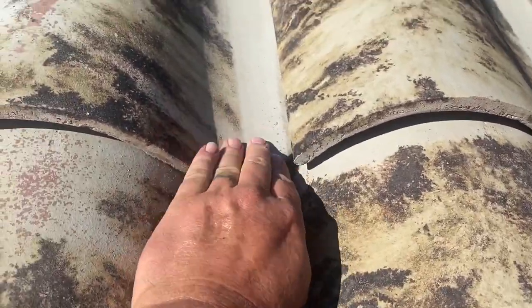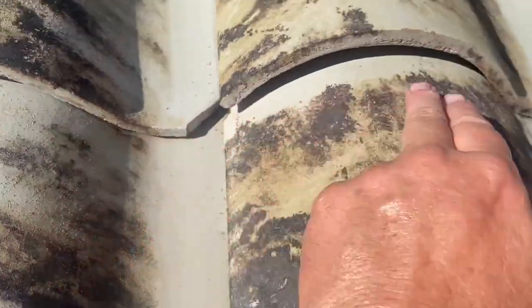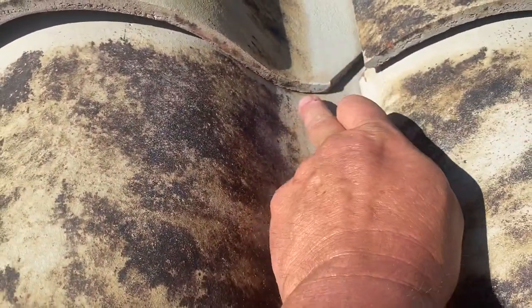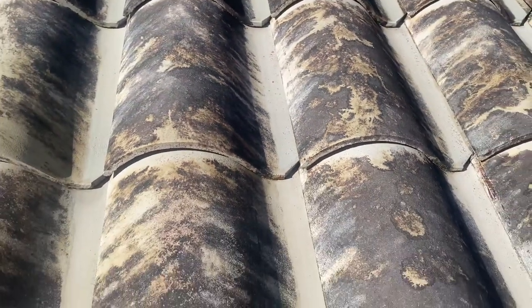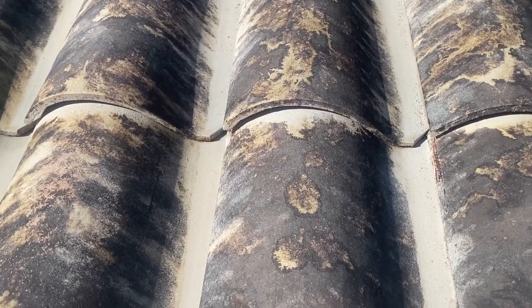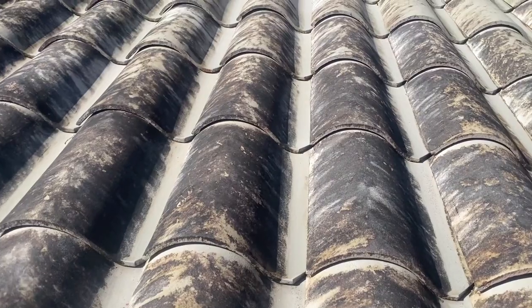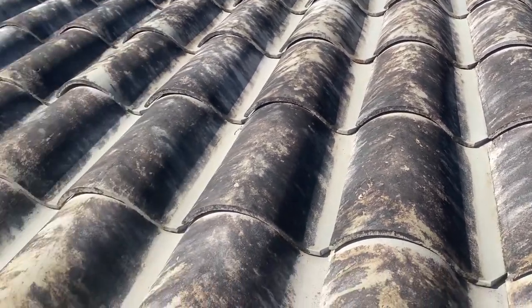In the valley where you have a lot of overlap on the shingles — in this area they're touching along in here. So these are the areas where you want to keep your footing on these. If you're a little skinny guy like Glenn Robertson or Jeff Robertson, who's just amazing at tile roofs, he can dance across all these things. I do recommend having the thinnest person on your crew walk these.